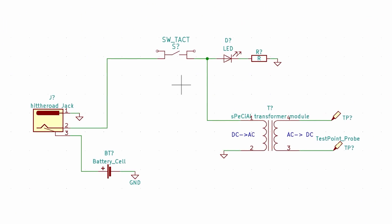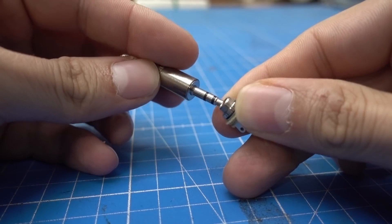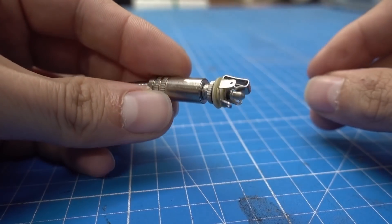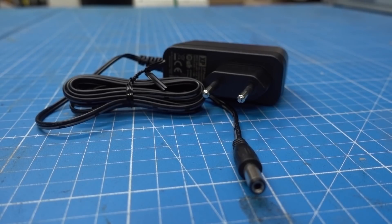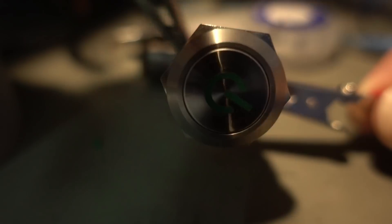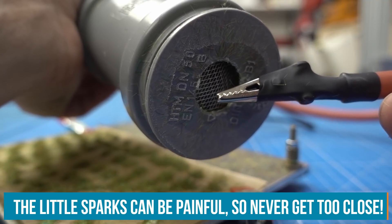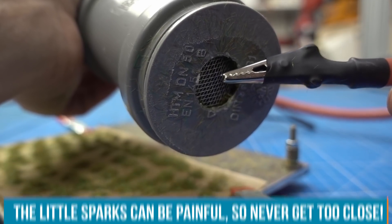What do you need for this project? I need a voltage source — in my case I want it to work with a nine-volt battery for wireless use, and also be able to use a nine-volt wall wart adapter. I need an input jack with a little switch inside so it automatically switches voltage sources when the wall adapter is present. I also wanted a really nice illuminated power button so I always know when the high voltage potential is present, because you can shock yourself with that and it hurts. The status LED is critical.